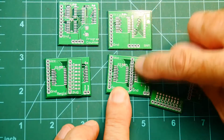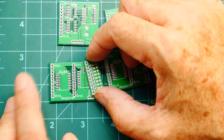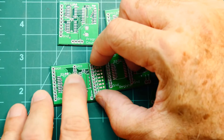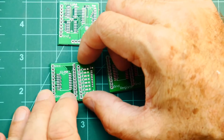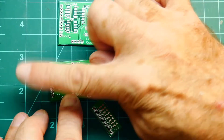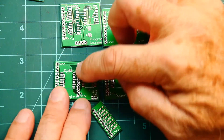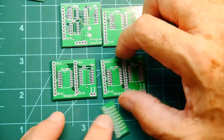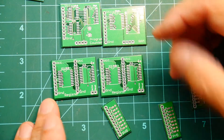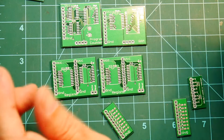Remember that this internal space here isn't needed if all you're going to do is talk to the bus. The first chip is a latch — when you write data in, it's stored in this chip and it's always outputting; the output is enabled all the time. So whatever is in this chip will be displayed on the LEDs. If you want to take that back out to the bus, you enable the tri-state buffer and it brings the data back around and sends it out. For the ALU, since these internal lines are always enabled, register A and register B lines will always be active, feeding directly into the ALU chips to perform the operation. The ALU output will always be active, then you follow that with a tri-state buffer to put it back onto the bus.